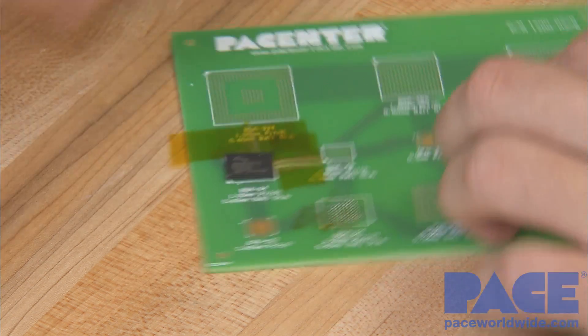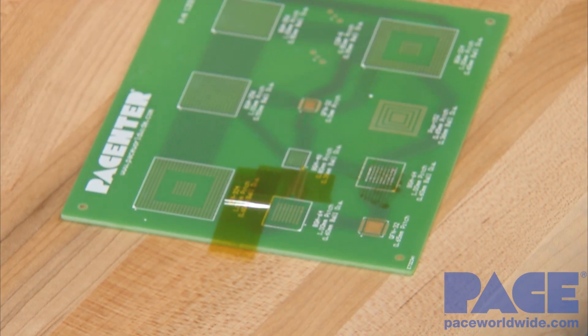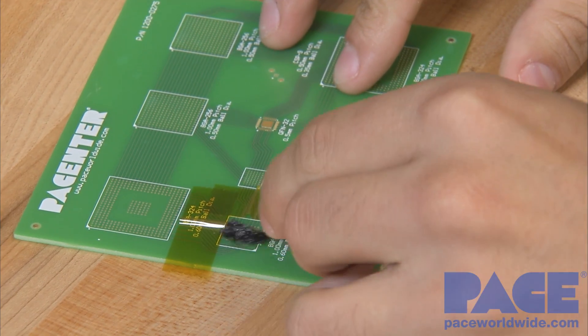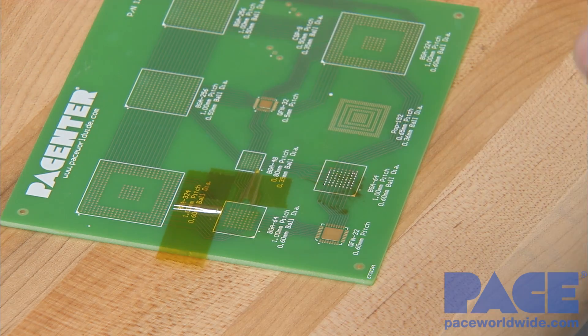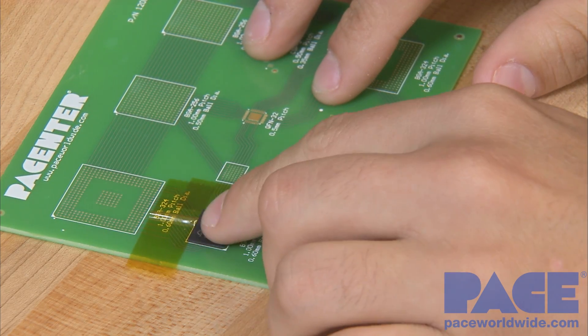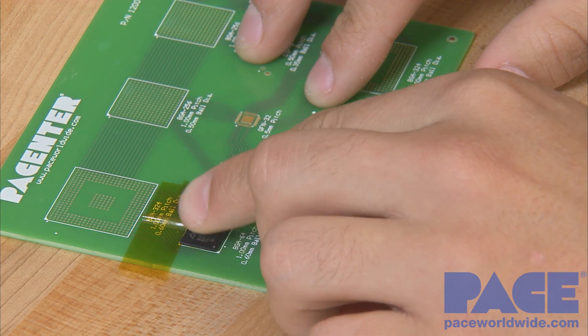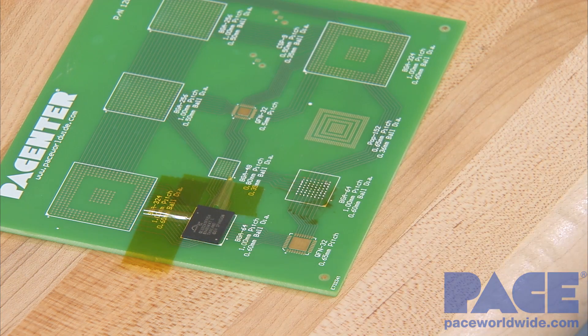It's pretty good there. So let's put some flux down and start the heating process. With this, we're actually using leaded solder, which is helpful because when you reflow the solder it will actually self-align itself onto the pads as long as you get it close enough. This does not hold true with lead-free solder — you'll actually have to put that under an x-ray and confirm the alignment there. So luckily we got the good stuff today.